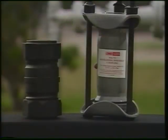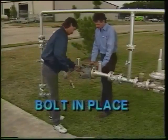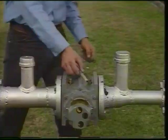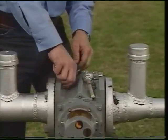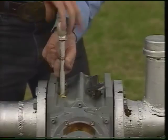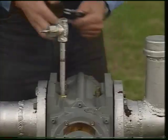Dresser recommends installing 1 or 2 flexible couplings that can compensate for misalignment and absorb vibration. Flange bolts should be torqued to not more than 80 foot-pounds for the 5/8 11 cap screws. Get the specs for other sizes from your manuals. Install any test plugs in the pressure taps. Installing them now eliminates taking the meter out of service later to install them.